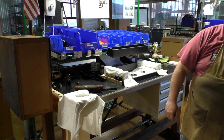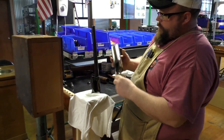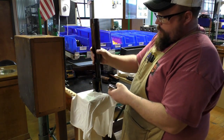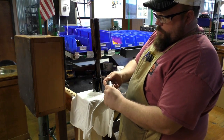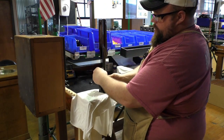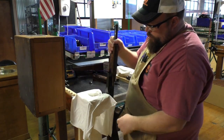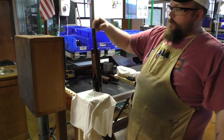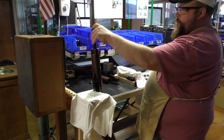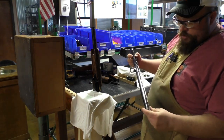So then we go from there back to our receiver. You've got your fore end, and you're going to assemble the slide bolt. Check the bolt, make sure there's no scratches, dings, or mars in the bolt. That assembles into the receiver. Make sure it's smooth. And then you're going to put your interior parts in, which I already have in this one. It's a spring follower and magazine limiter under the magazine. Barrel assemblies. Check those all over, make sure there's no scratches or marks.